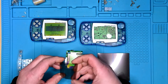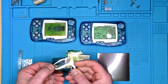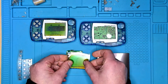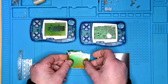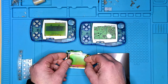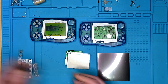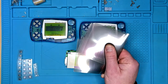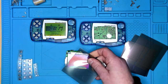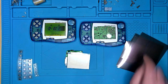So I took the screen out and then realised that the polarising film had actually gone — it had peeled away, and you can see that at the bottom edge, all the way around. So I removed it. I remembered seeing videos about Game Boy polarising films and thought, well, surely I could do the same trick here and replace the damaged polarising film with a fresh one.